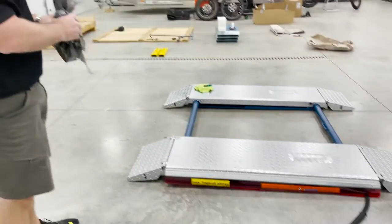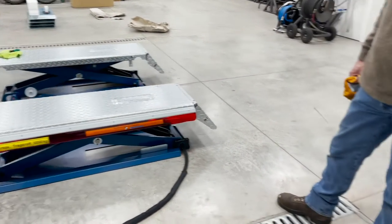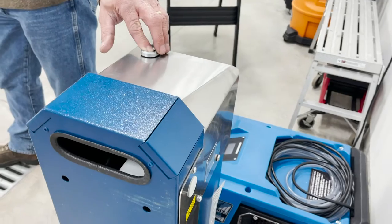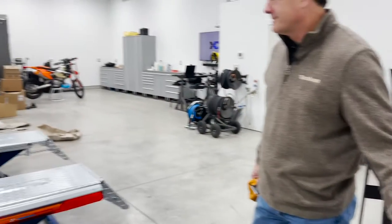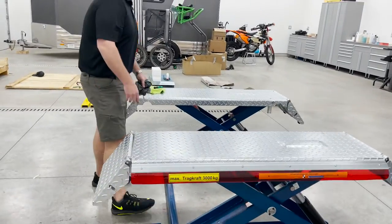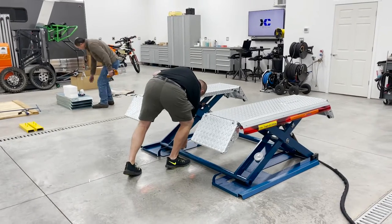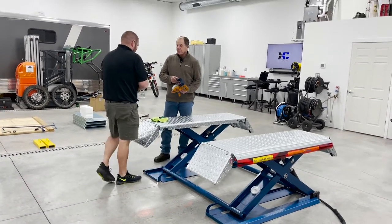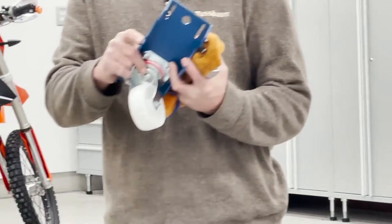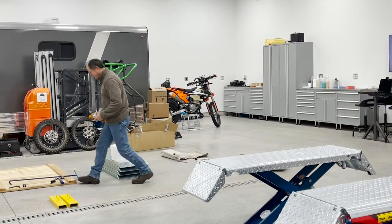The one thing it is not meant to do, though, you can't put those wheels on there and then lower your car on it and expect to move your car around the shop. That's a great disclaimer. I'm assuming that's been tried at least once, or otherwise you wouldn't have said that. Yes, it has. The first place that'll go when you do that is that little place right there. It will just spread that right where it goes around the dog on the transverse. It'll just spread that right out. Again, I'm assuming you've seen that more than once.